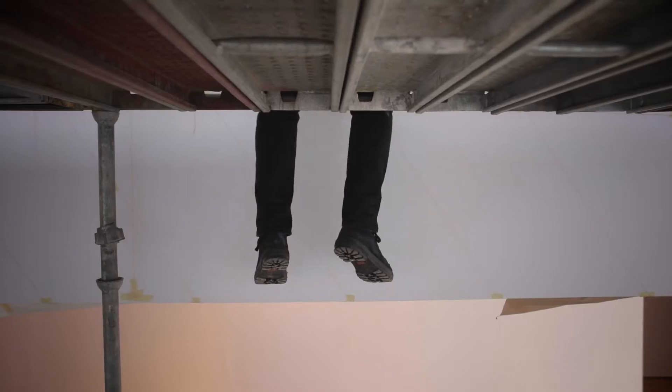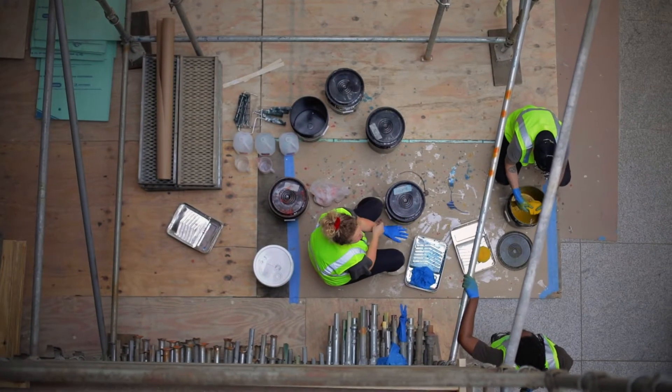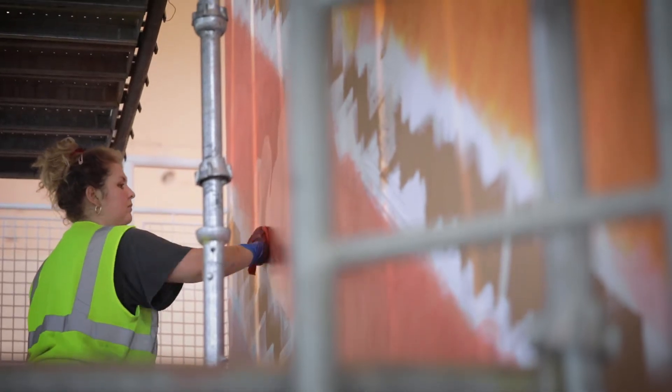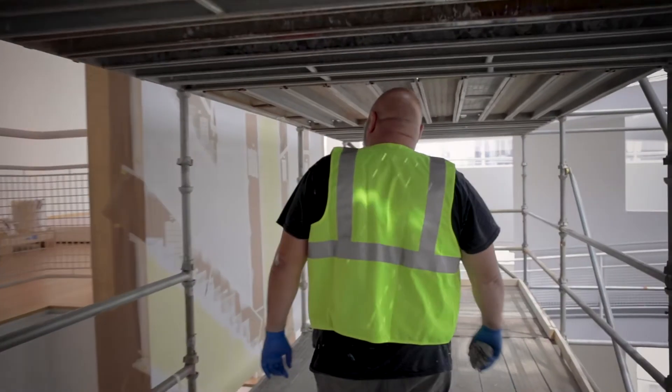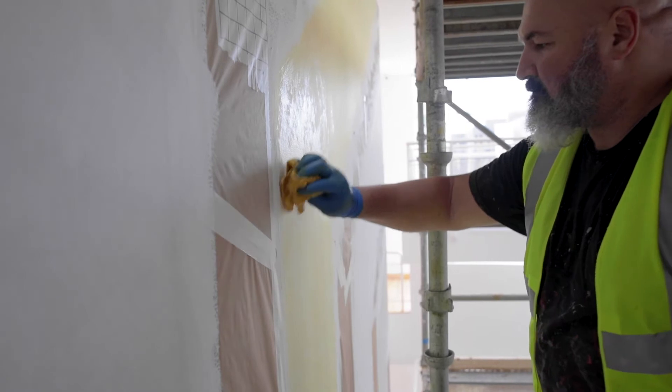Because I'm used to either using a roller or a brush or a spray can, but in this process we use rags. The process is known as wipe, boom, wipe. A wipe is taking the rag and making a hamburger-like patty in your hand with it, then using the smooth side of the rag to wipe the paint onto the wall. The boom is reversing that and using the rough side, actually booming or bouncing off the wall, and that creates this mineral-like texture.